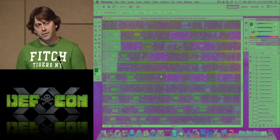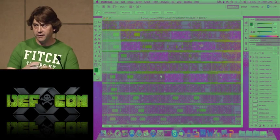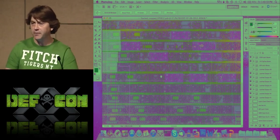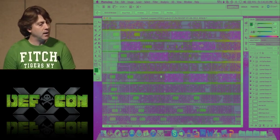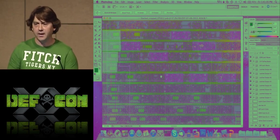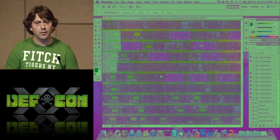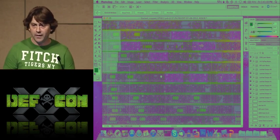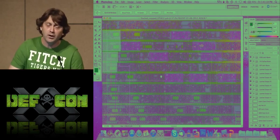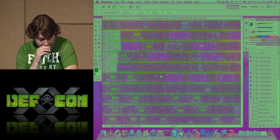Also, these are sets of 8 flip-flops that are all the same type of flip-flop. They're not different types of flip-flops. The other input, they didn't all go to the same kind of flip-flops, and they didn't all go to flip-flops actually. So that would make more sense to me that would be where the operand is being latched. Or not latched, but being looked at and analyzed, potentially latched. It just depends how they interpret.